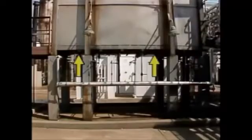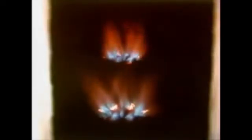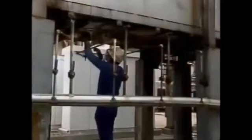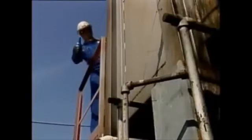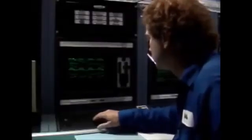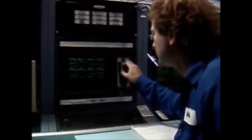The operators will light the burners in a staggered pattern to provide a good distribution of heat in the furnace. If one burner goes out while the others stay lit, it may be necessary to shut off the fuel to that burner for a few minutes to let the fuel burn off and then relight the burner. When all the burners are lit, fuel flow will have to be increased to reach the desired charge temperature. As fuel flow is increased, the air registers may have to be adjusted to get the proper flame size and pattern — one operator checks the flames while the other works the registers, using signals to communicate. When the burners are firing properly and the process fluid is at its normal temperature, the system is switched over to automatic control. From now on, changes in the process fluid outlet temperature will automatically trigger changes in the amount of fuel sent to the burners.